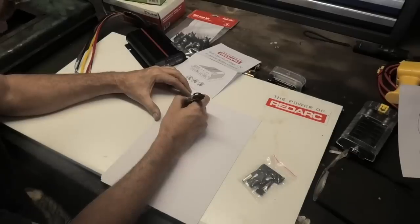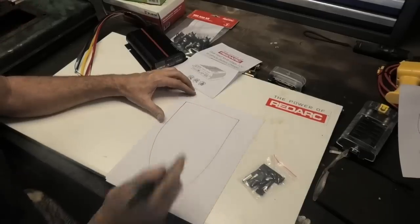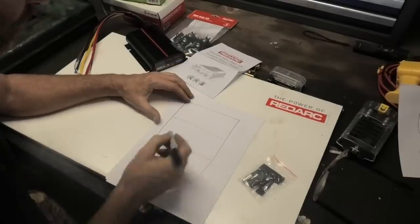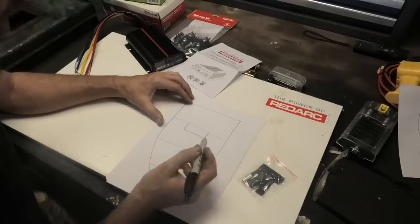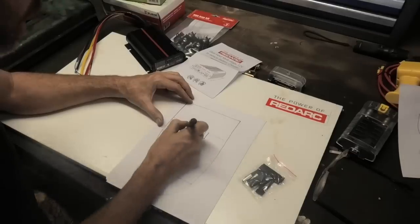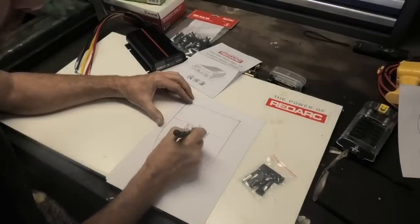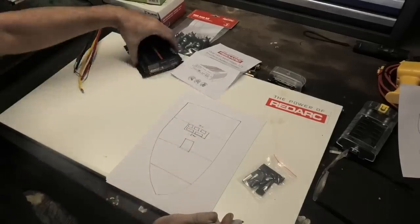Let's start with just a rough drawing of the boat from above and talk about batteries. We've got the lazarette here, the engine bay about here, the front cabin here and the anchor well here — those are my main four compartments. There's going to be a shelf in the engine bay where the batteries were originally. I've got three house batteries which are AGM 130-amp batteries and two large starting batteries. The house batteries will be in parallel for my 12-volt system, and the two large starting batteries are in series for my 24-volt system.